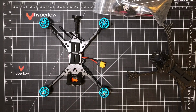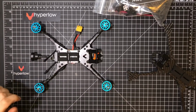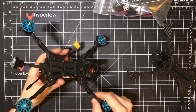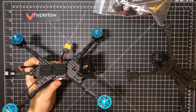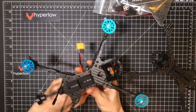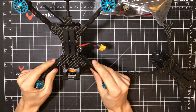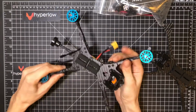It's definitely a little different than most out there, and I will talk a little bit more about its performance later in the video in comparing it to the top mount CG. But its main draw is its solidly centralized mass. This battery placement keeps everything nice and tight and in the prop plane, making it effortlessly smooth to fly, and it gives it a larger tuning window also. So its performance goals are very similar to the Remix, but the main difference is this being a stretched X and also having vertical arms.